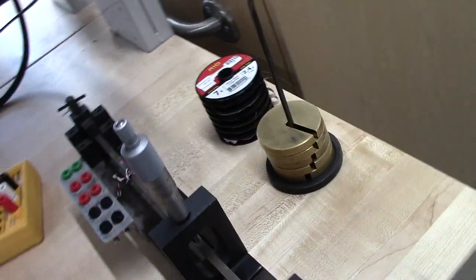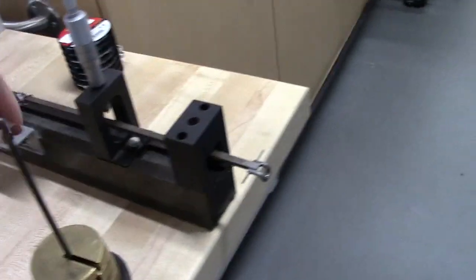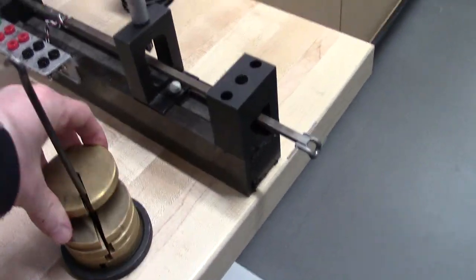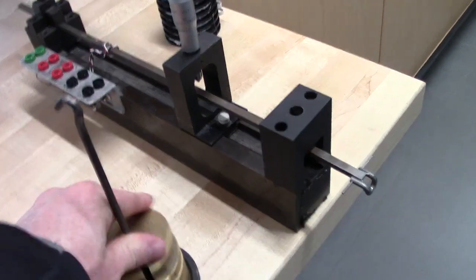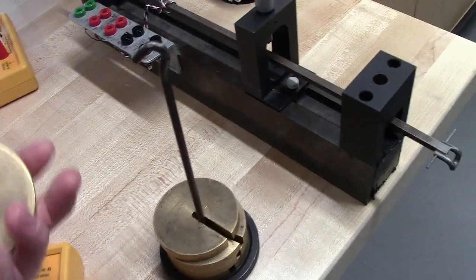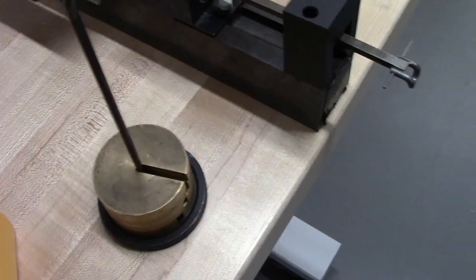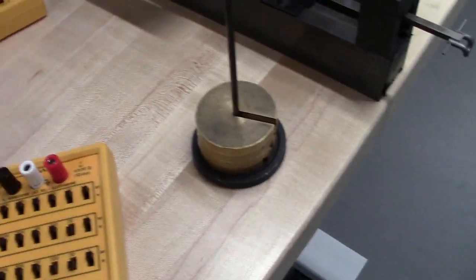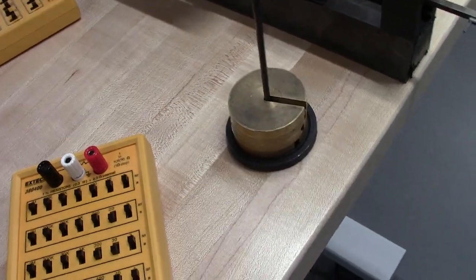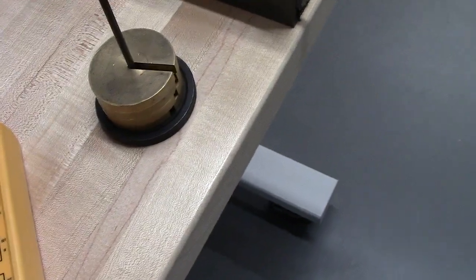We'll do that. So with this weight system, you can hang this on the end. You'll do it for different increments, say maybe like 5 different increments. Some of these are labeled, and some of them are correct, and some of them are intended for a balance that has times 2 the mass. So we do have a digital scale. You'll want to measure each of these just to make sure that you actually have the correct mass that it's labeled as, and it wasn't intended to be used in a device where you're getting times 2 the mass.